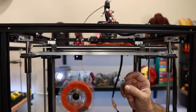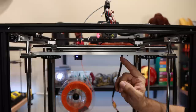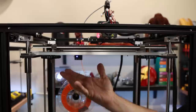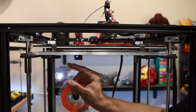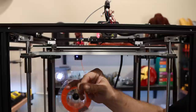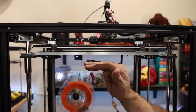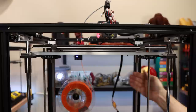Step two: right underneath the bed you'll see two aluminum bars — the top one mounted directly to the bed, and the bottom one where the screws are mounted. We want to create just a little bit of an air gap between these bars. That allows us to have a good mostly-level starting point while ensuring we can go both down and up a little bit during manual leveling. We want a couple of millimeters — two, three, four — nothing specific, but about the same all the way around the bottom of the bed.